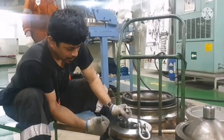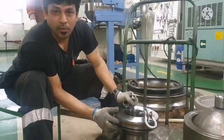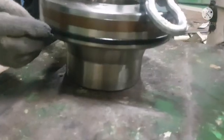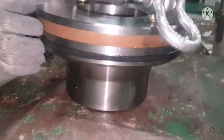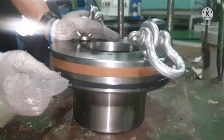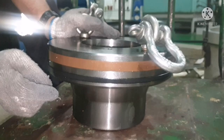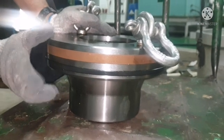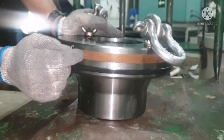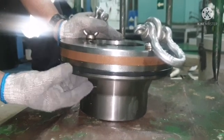What we are seeing now is the exhaust valve air piston. You can see two sealing rings. Whenever we do overhauling of this air piston, we need to renew both the seal rings. This seal ring is of Teflon, so whenever you remove it, we have to cut it — then only we can remove it.